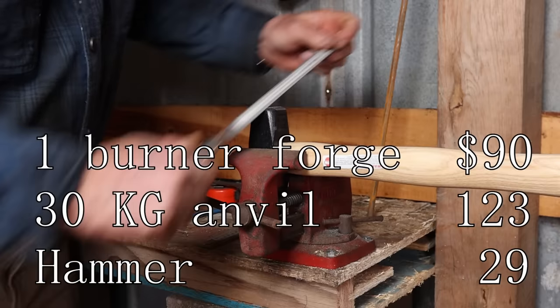We went to various antique stores the other day and I saw these ranging from $25 to about $150. The $150 one was the one that was the most beat up and in the worst shape. And the $25 one looked plenty serviceable. eBay is full of these things at all sorts of price ranges. The bigger, the heavier the vise, the happier you're going to be with it. Getting a little 2-inch vise that they often call a jeweler's vise probably isn't the best, but it would also probably get the job done.